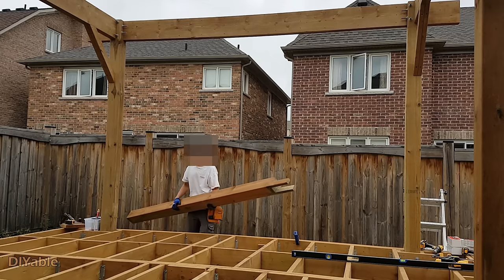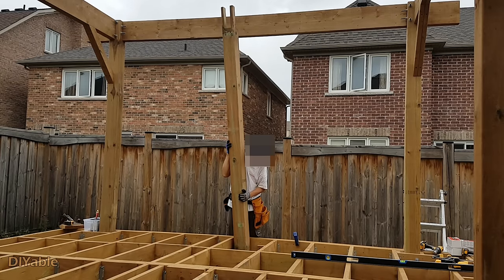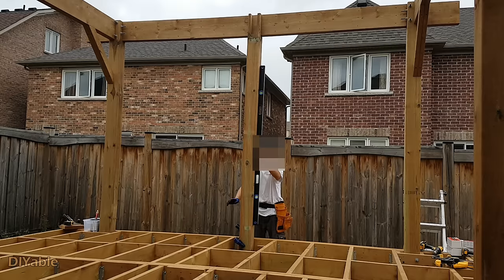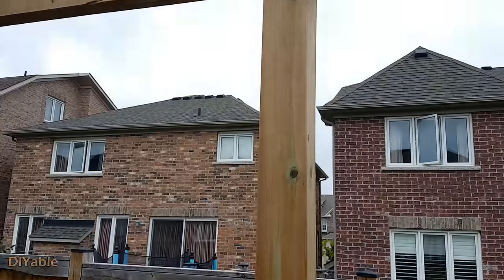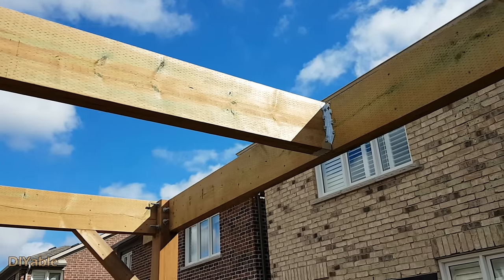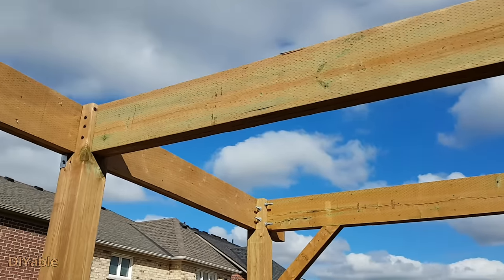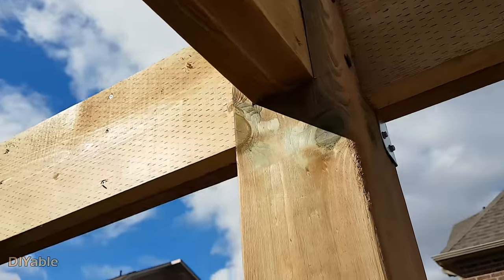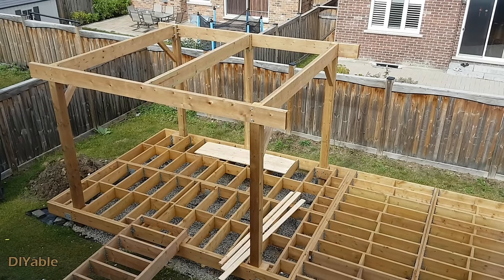This post will go to the back for two purposes: first, it acts as a privacy screen to block the neighbors at the back; second, it is used as a top divider so that I can install a retractable shade in the future. The middle divider has been installed. For this end I am using double joist hangers, and for the other side it will be sitting on the 6x6 post. It looks very solid. At the back I am using a metal bracket. This is how it looks from upstairs — looking good.